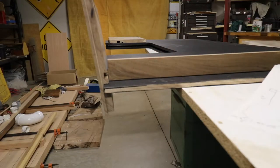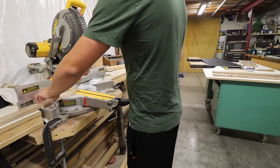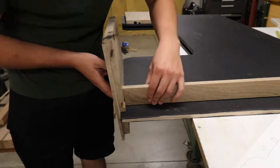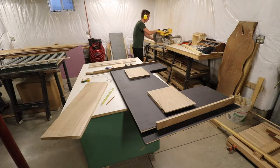Since there was an angle to the face piece, the spacer piece did not line up completely correctly, so an angled cut on the chop saw had to be done. As you can see here, the joinery is much better. Because the initial spacer pieces weren't long enough, I had to cut out an extra piece in order to fill out the length.